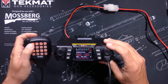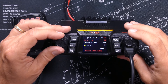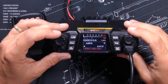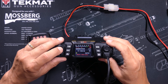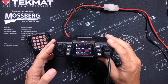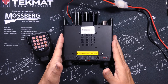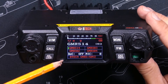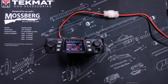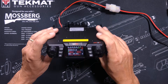This radio is based on the older GMRS 50 X1 and looks pretty much the same on the outside, but there are changes to the guts of the radio. There are updated audio filters specifically made for GMRS — the old GMRS 50 X1 used generic VHF and UHF filtering, so this radio should be more sensitive in the GMRS range. The power transmitter electronics have been upgraded so that they can output full power without dropping while you transmit. The screen is full color and very customizable — you can change almost every line to whatever color you want. The screen is bright and easy to read, however it is on the small side.